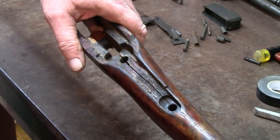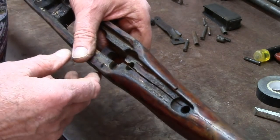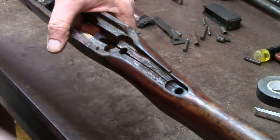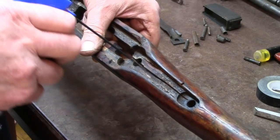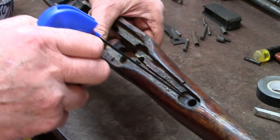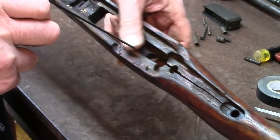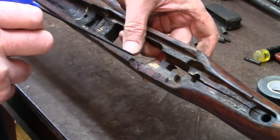I've done quite a lot of degreasing, soaking, cleaning, scraping, and chiseling, and I've blown out these cracks with air to be sure I have no dirt lingering between the wood surfaces, because just one little grain of dirt can inhibit a good tight bond.